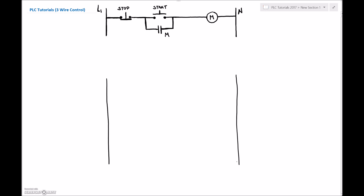On either side, I'm going to have my inputs and my outputs — inputs on the left, outputs on the right-hand side. For my inputs, if I plug 120 volts into the PLC, then there is 24 volts DC available that I can use to go out to my inputs. The other side is 0 volts — so positive 24 volts and 0 for my common, which I'll label as my negative.